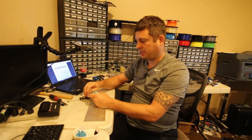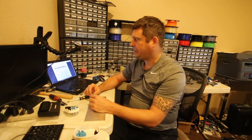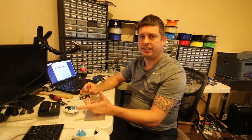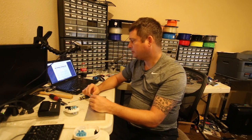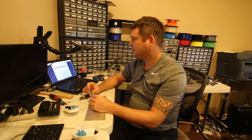Let's get to the part we're really interested in — the computer. They've got a computer board and a high-voltage board. They're using a MediaTek 7688AN, which is a system-on-a-chip targeted for Internet of Things. It retails for about $13, so I have a real hard time understanding how they can sell it in the United States for $5. It's a 2.4 GHz Wi-Fi chip — pretty hefty — supporting B, G, and N. It runs at 580 MHz, and it's a 32-bit device with apparently 2 megs of RAM.